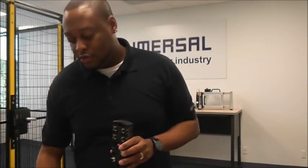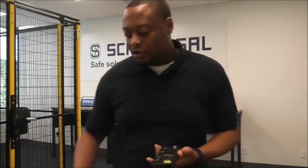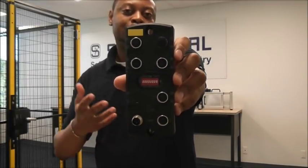Some things that come with the delivery of the PFB include labels. Because you can have many devices connected into your system, it's good practice to label each connector — for example, connector one might be an AZM200, connector two might be an RSS16, and so on. We provide a nice easy labeling system. Also included in the delivery are end caps, which go over any unused connectors. As you can see on the cap, it has a slotted head so you can screw it down further.